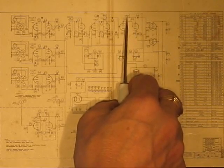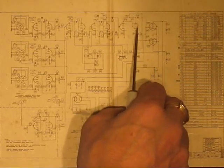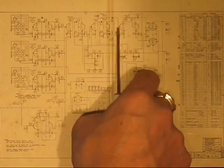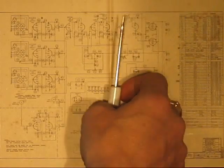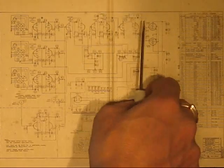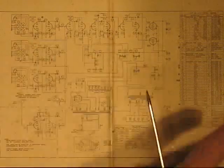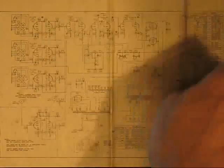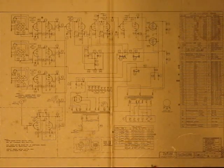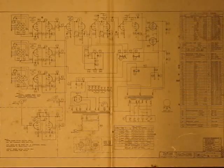Do check your current limiting resistor for, you know, whatever the impedance connected to that grid is. You have to be aware of that, and that you're going to be grounding it. I doubt very seriously if any one of these grids is going to be sitting at B+. So it's pretty safe. Just make sure you're on the right pin for the grids of these tubes, and back your way up until you find the grid that, with full coupling, gives you a nice deep tremolo effect. And then you can add a potentiometer and play around with the coupling capacitors in there to trim that.